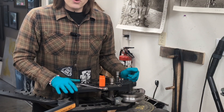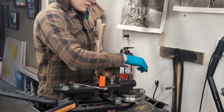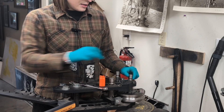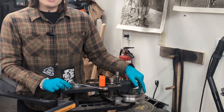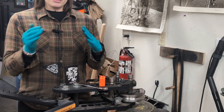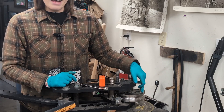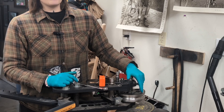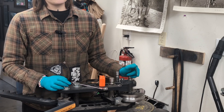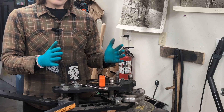The bending setup I use for handlebars is a JD Squared Model 32 with a 7/8 bending die for a 3.5-inch centerline radius. 3.5 inches seems to be the tightest I can bend this thickness of 4130 without getting big dimples in the bend or any rippling. I originally used a 6.5-inch centerline die, but you had to spread the first and second bends out too far and it was really hard to make anything lower than 60 millimeters of rise. The tighter bend lets everything get more compact — you can make lower rise bars with way more backsweep.